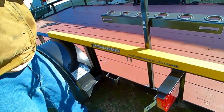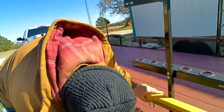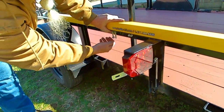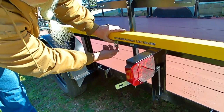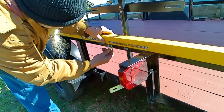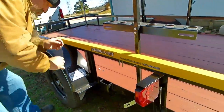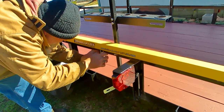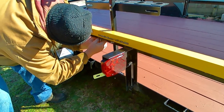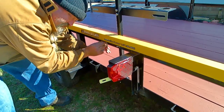Once you drill half inch holes, that's an awful lot of slop. So I drilled 3/8 holes, which is enough to let the shoulder fall down inside the angle iron for the side rail. Too much slop because these are 5/16 bolts.